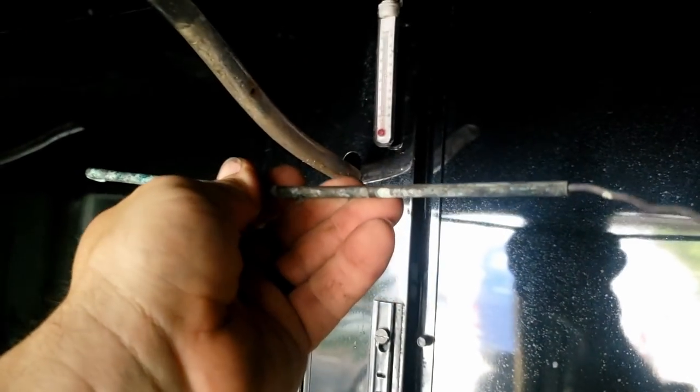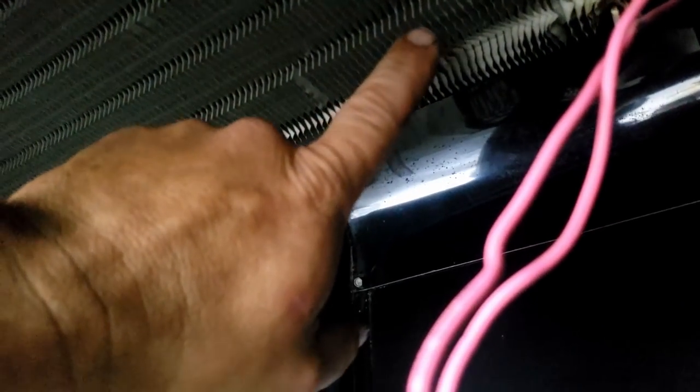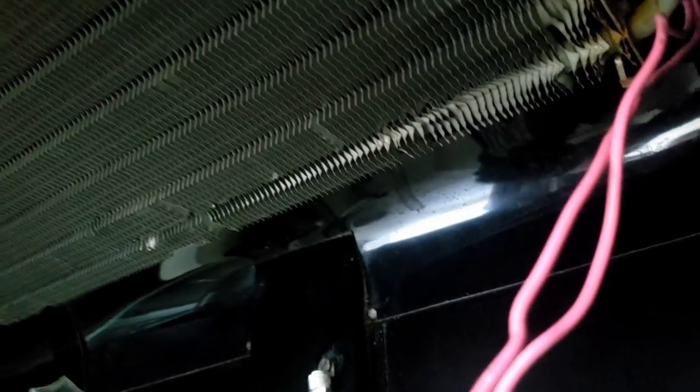Here's the tube for our thermostat — it goes right in here and that's how it knows to defrost. We're going to have to make sure we wire-tie that thing in the coil, because if it's not seated in the coil it's not going to naturally defrost itself. We'll need to run some heat on the frozen evaporator to melt it and then start diagnosing whether there's a leak.